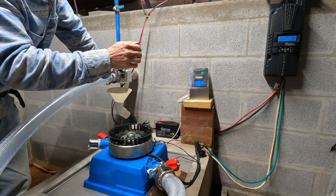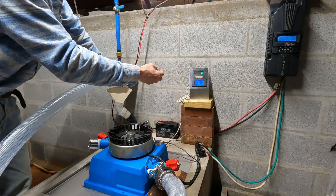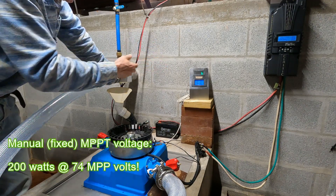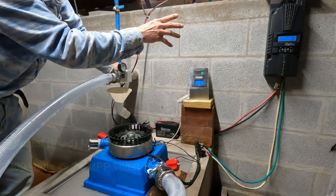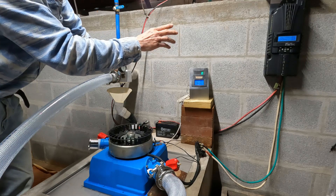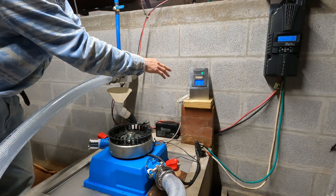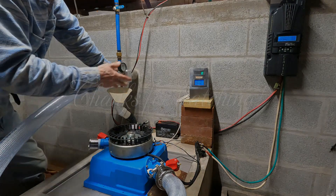I looked at the voltage and knew I'd be able to hold it there because it was showing 200 watts was achievable. By setting the voltage manually — right now at 74 — we're really close and getting 200 watts. We don't have to worry about the system dancing up and down. Fixing it to a set voltage, we're able to get the right power right from the get-go without having the MPPT trying to find that point.